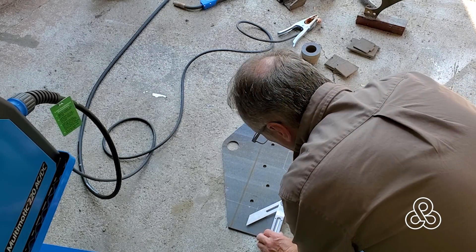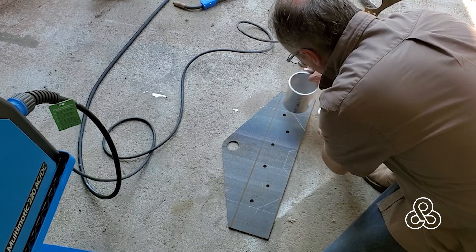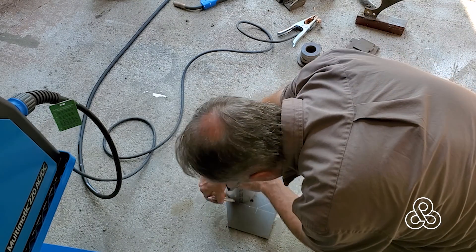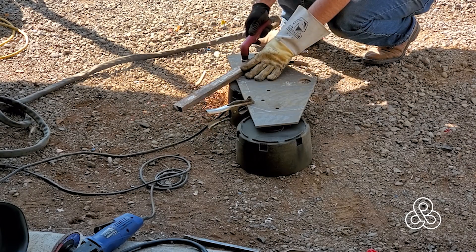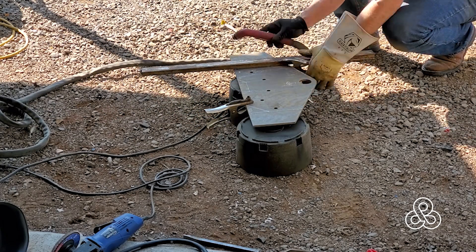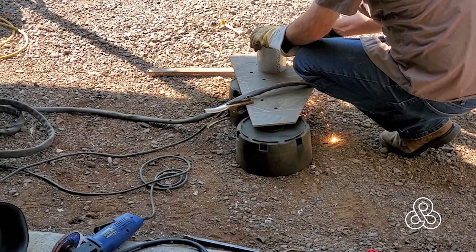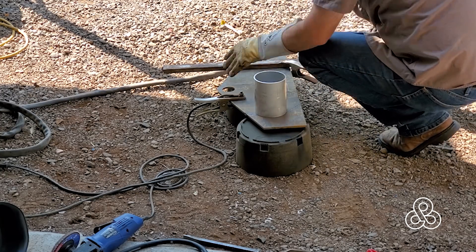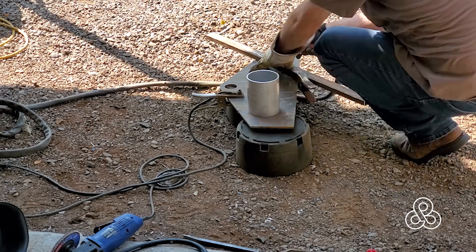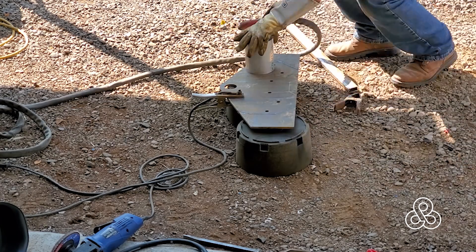This three-point mounting system is built out of a bunch of quarter-inch steel plate. A couple of the points on this mounting system I had previously waterjet cut, but I decided they stuck off the ends a little more than needed for actual support on this frame. So we're going to trim it all down — probably shed about six pounds off each plate by just taking the plasma cutter and cutting it down. I then went back to KCI and had them waterjet cut the second set to the proper size.